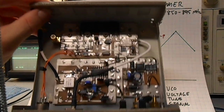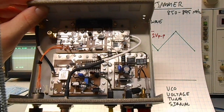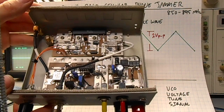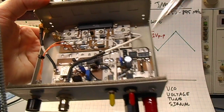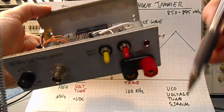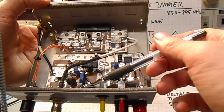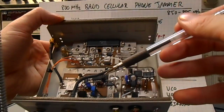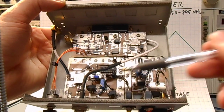In the jammer I made, I'm using the XR2206 function generator to generate the triangle wave. The frequency is determined by two components: a single capacitor and a single resistor. They should be of high quality because you don't want temperature changes to affect your performance. Three potentiometers are just below it right here. The multi-turn potentiometers are for the DC offset.